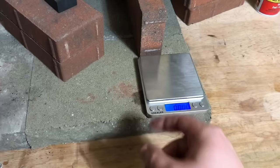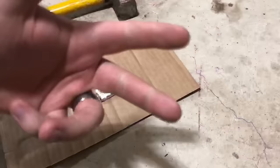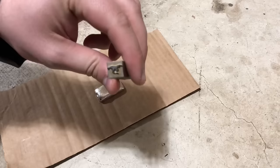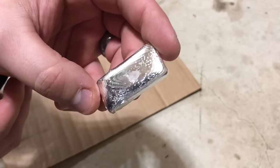on that thing. But I got my scale here. Let's see how much it weighs. All right, 2.18. That's about perfect. Okay, so the next step is to put my dragon stamp on the bar, and then I can go ahead and tumble it. I like to get my stamp on there first because once I go to tumble this, it's actually gonna make the silver a little bit harder, and so it'll be more difficult to get the stamp on there, so I'm just gonna do it now.